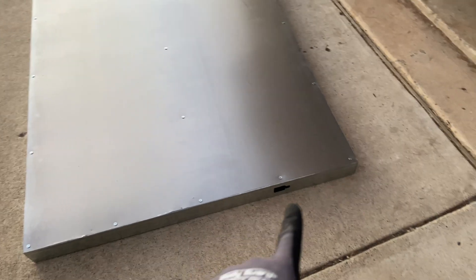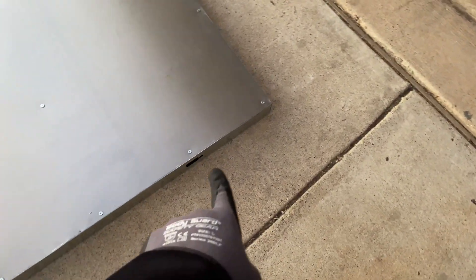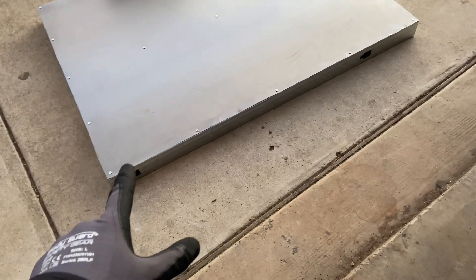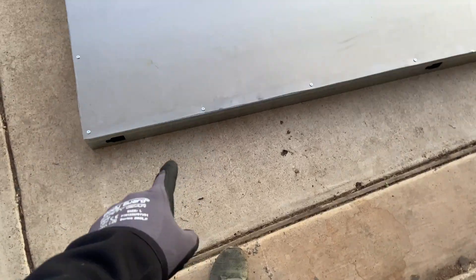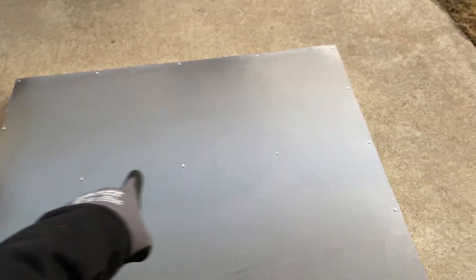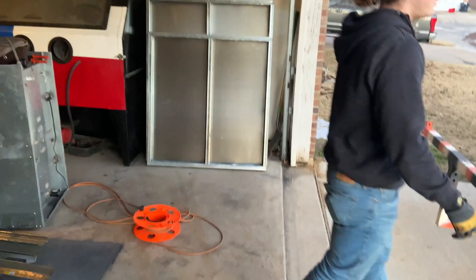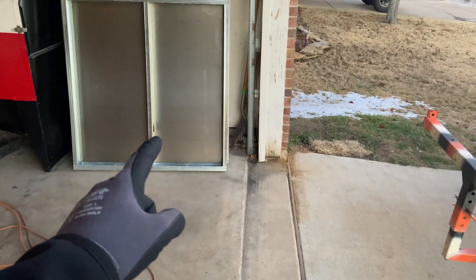This is our door — it's four feet wide exactly. What we did is put two in the corners, then one foot, two foot, three foot — so there are five total running that way. As far as height, it's five feet three and three-quarter inches. What we did was go to about half and then split the difference between the two; we have a stud running in the middle. That's pretty much how we did all the walls. So far we have one side of the door, one side of the roof, one side of the back, and one side of each interior wall.